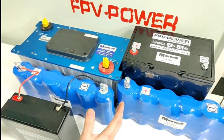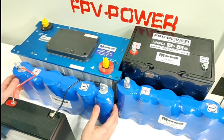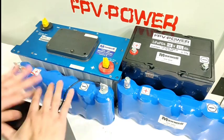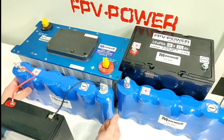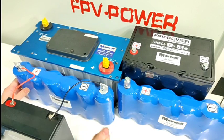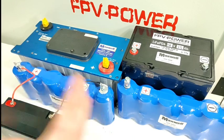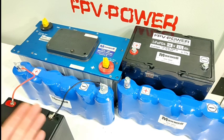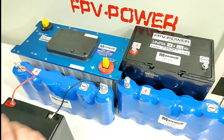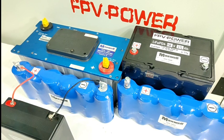But this, just to give you a reference point: a 2.4-liter, four-cylinder car, no batteries, just a supercapacitor, fully charged, you can crank it for 30 seconds, meaning until the starter motor starts clicking. So that's a whole 30 seconds on a 2.4-liter petrol engine, mind you, four-cylinder.